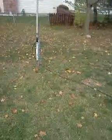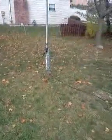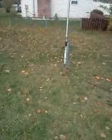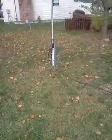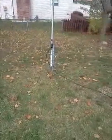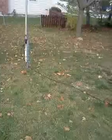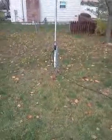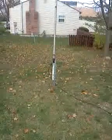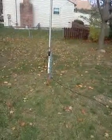The antenna happens to be a 1.3, maybe a 1.2, depending on where you're at on 15 meters without a tuner. Don't play too much 15 meter, but I'll have to see how it works since the SWR says it's good on the antenna analyzer. K8YIO at yahoo.com. We hang out on 7.200 MHz in the morning — if you hear us, give us a call. Make any comments you like on the video. And again, I hope this video is brighter. This is my ugly K8YIO 40 meter ground mounted vertical.